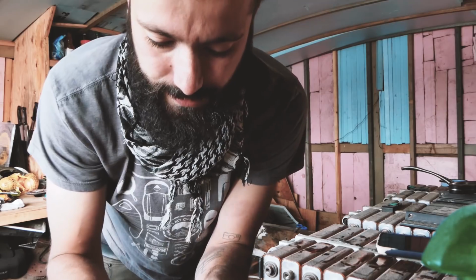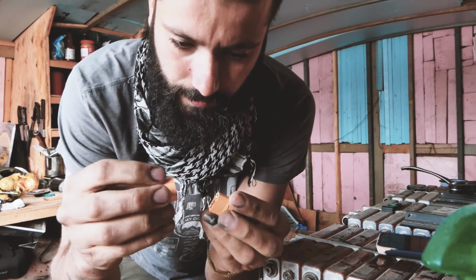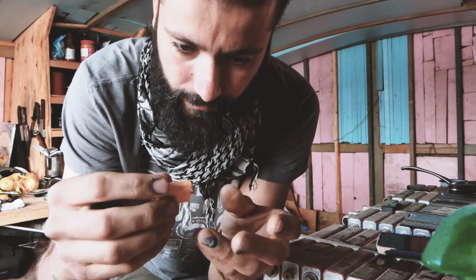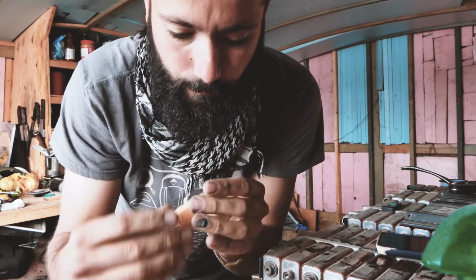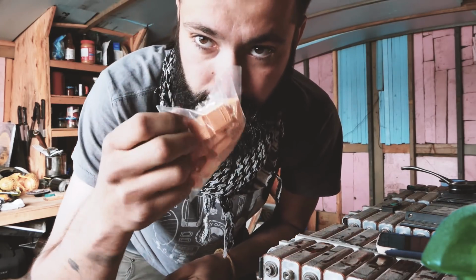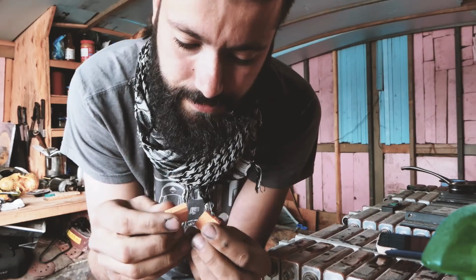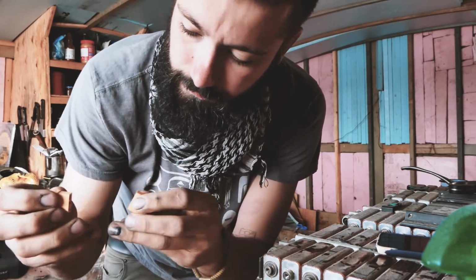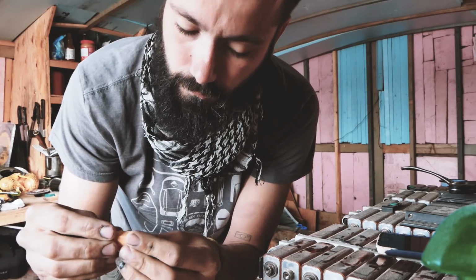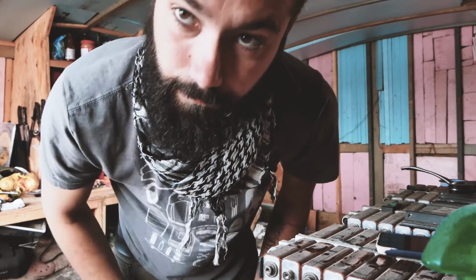And they're nice and recessed and safe, so I don't accidentally get shorts. And I think I might use them throughout for all the heavy 48 volt connectors, because a whole bag of these are like $1 each, much more affordable than other options. And I've had plenty of great experiences using them with RC applications and all kinds of places. So yeah, we'll solder a couple of these in. We'll start getting the final bits of the batteries done.